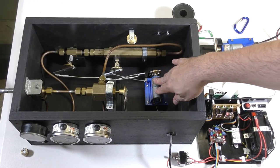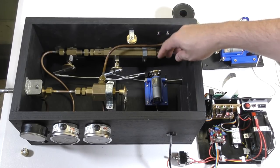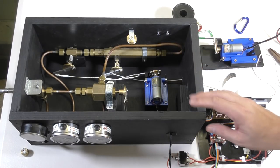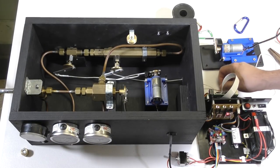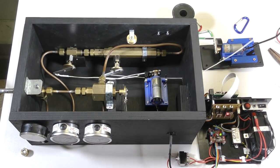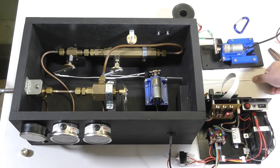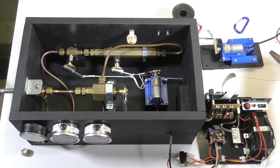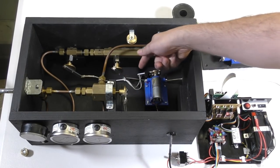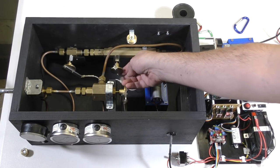And now if something should go wrong with the motor itself, if the battery dies or the limit switches break or there's a connection that's broken and the rocket's pressurized, we still want to be able to depressurize it. So we have a manual backup system and there's a string that goes back to the launch controller that we can just pull manually and that'll release the pressure also. And that's another reason why we use the string and not a hard linkage, is so that these two can operate independently of each other.